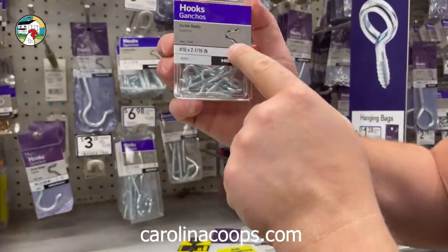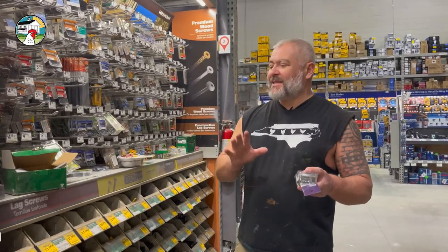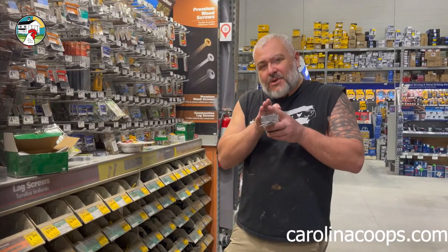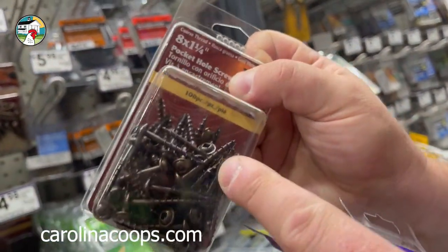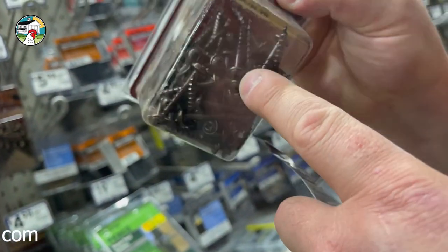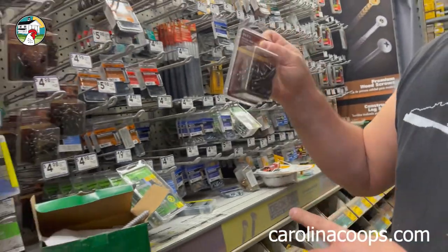That's a shepherd's hook — because it looks like a shepherd's hook! Now let's find some chain. I was thinking — I know I talked about the drywall screws mainly because I know they will work and they're inexpensive, but the bugle head does have a tendency to try to split the grain. One of my favorite screws — we use these in all of our coops — is what I call a pan head. It's a pocket hole screw, but that pan head acts like a washer and flattens against the Luan to clamp it. If you really want to get fancy, grab some pocket hole screws.